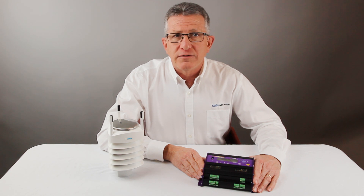The SDI-12 protocol uses three parameters to identify the value to be measured: the address of the device, the register set of the data, and the particular data item within the register set. In some data loggers, programming the correct syntax to retrieve a particular item can be quite complex. However, the DT82E uses a web-based graphical programming tool called DEX for configuration.